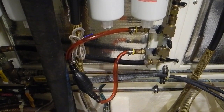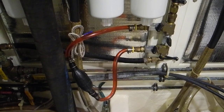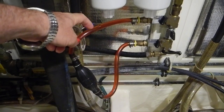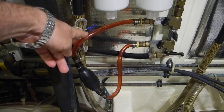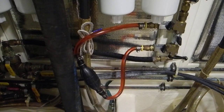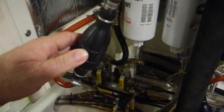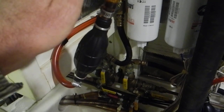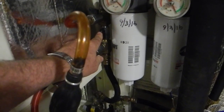The point I want to make is that squeeze bulb is not certified for below-deck use — that's an outboard squeeze bulb for gasoline. And this hose right here, you can see a little bubble moving back and forth in it — that's full of cranberry-colored off-road diesel fuel, and that is not a certified fuel hose. Looking to the left a little bit, you can see this bulb over here — it's rock hard, it's old, it's rock hard. And again, we've got this hose up here that's not a certified fuel hose.